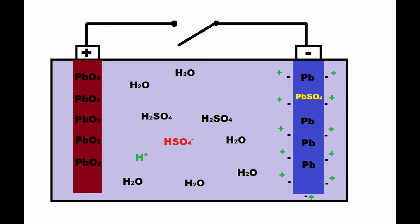What we can do is connect a conductive circuit made from copper wire between the negative terminal and the positive terminal of the battery. In this diagram you can see this circuit connected up between the two terminals with a switch, which allows me to open and close the circuit. When I close the switch, it allows the free electrons to flow through the circuit from the negative terminal to the positive terminal due to the potential difference or voltage between the battery terminals. Lead dioxide itself is also a very good conductor, so free electrons become available at the surface of the electrode and reactions can begin at the surface of the lead dioxide electrode.